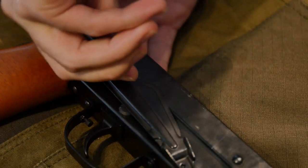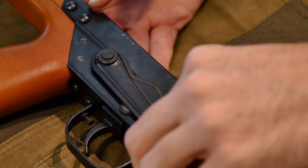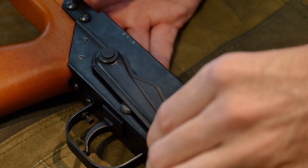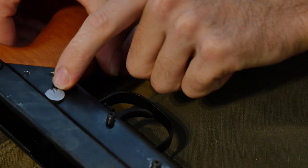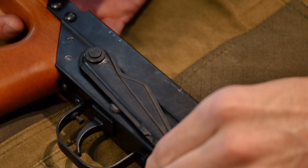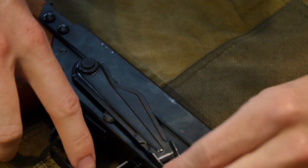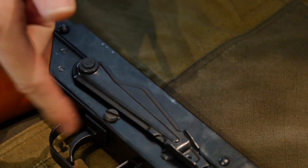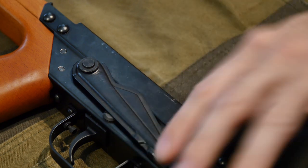You can see it's already about as tight as I'd probably want it. At this point you can check your over-travel stop — on mine it goes a little past the receiver, but it keeps you from flicking it hard and having it go completely off your gun. What will be nice is once I get the side rail on here, the ball detent and side rail will keep it in this position so there's no risk of vibration during firing working it up and inadvertently putting the trigger on safe. You can see there's very little room to play around with here, which is why you need everything to be pretty rigid and not moving under vibration.